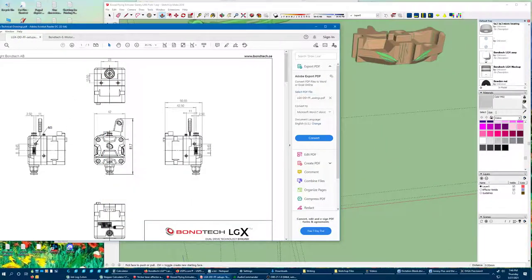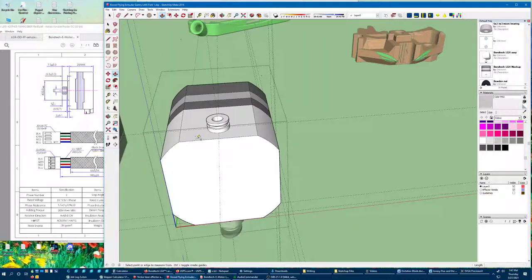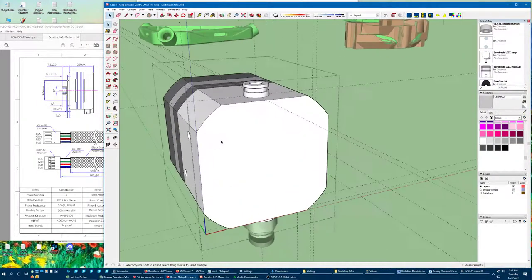I feel like this has got sharper corners than the stepper I measured this off of — maybe because it's a pancake and the other one is huge. Using a ruler on the screen: this is actually 44 millimeters on my screen and that edge is about 4 millimeters. So how much did I end up with? Seven — that's much too much. Going back, let's fix this. I am dragging two lines off of that corner. Probably a little less than 4 millimeters. It does look like it's almost not radiused.